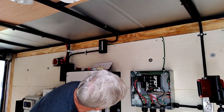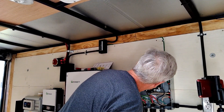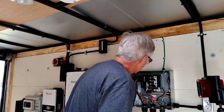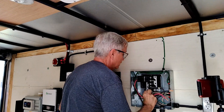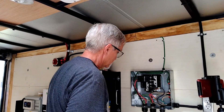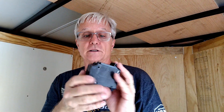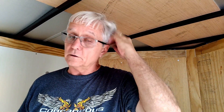I've got one more circuit to bring in. Hey, I've got one more grounding hole — how about that, without having to go buy another ground bar. I've got a 60-amp double-pole breaker going in there — this is the main feed going to feed the house, going to feed the off-grid farm, leaving this box and leaving the inverter.